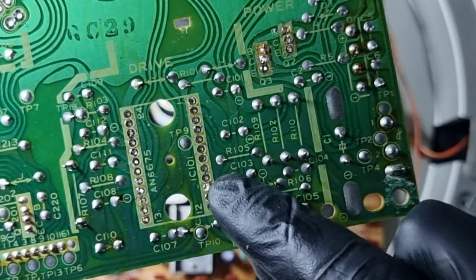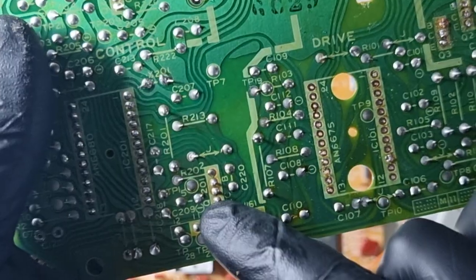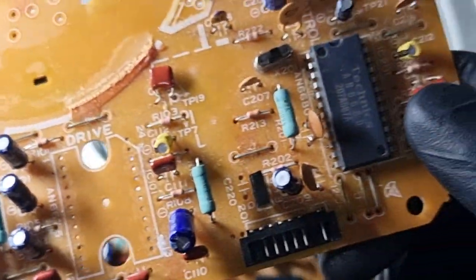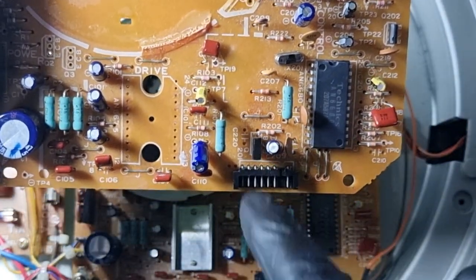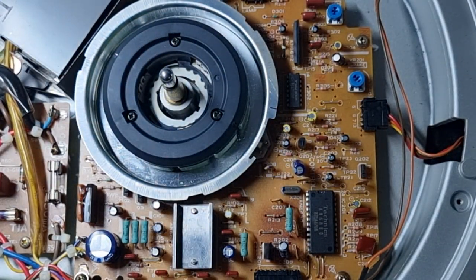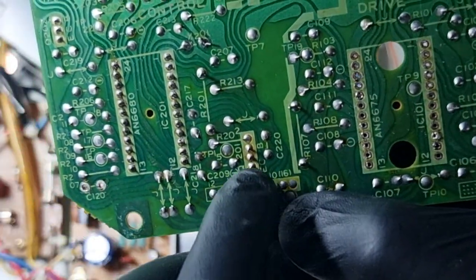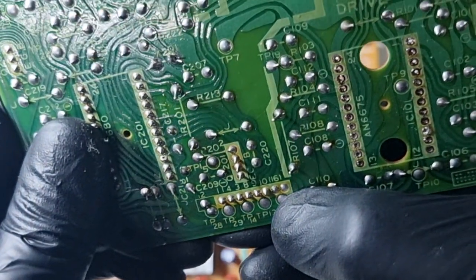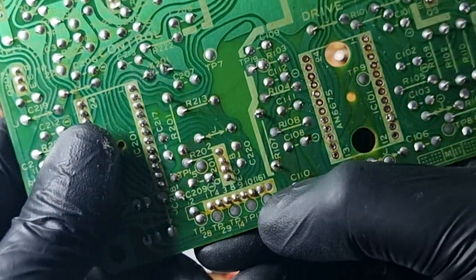We've got a similar thing here with the drive chip assembly layout for the heat pads. But at the back of Q201 that you can see here, the component is actually still on the board. So this is the component that I'm trying to tell you about. If we look here and then look here, this is the same layout and exactly the same component. If you turn this the other way around, this is what it looks like. You have the three connecting points here for the transistor. If you have movement, which obviously this doesn't, this has been reflowed. Actually, no, it hasn't, sorry. This is just standard, but it is in good condition.